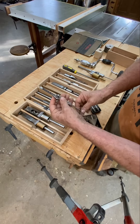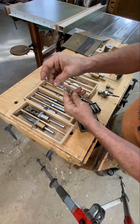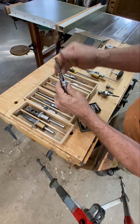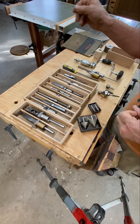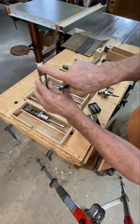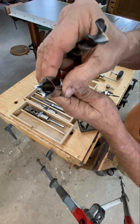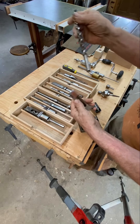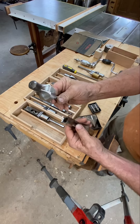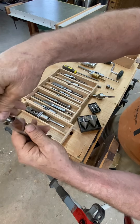This is a Japanese pattern. What distinguishes a Japanese pattern is it has a large flute, a spur — a single spur — and they're a little more pointy at the ends. That's a Japanese pattern; it's the only one still manufactured. Now a British pattern, which is the original ones — you'll notice that it has less of a sharp point, and the insides actually have a little file mark. So there's a slightly different sharpening.